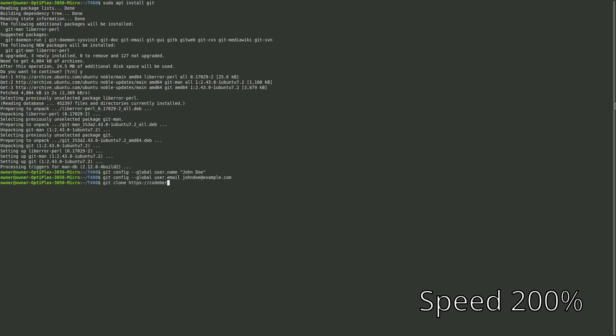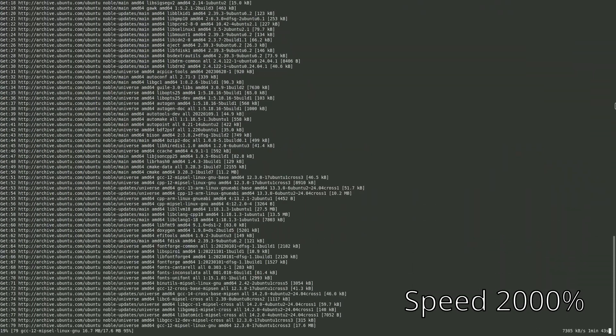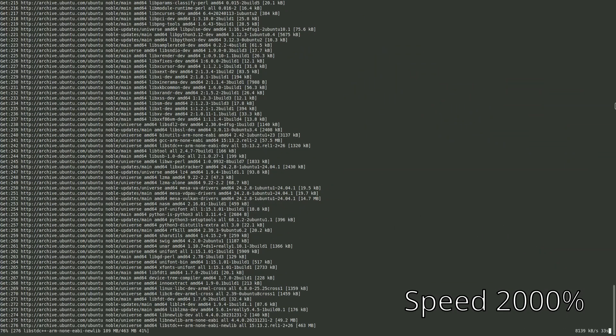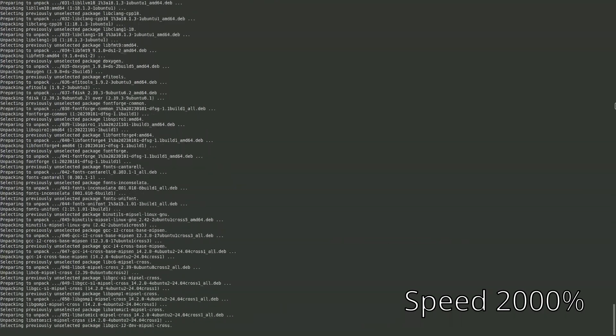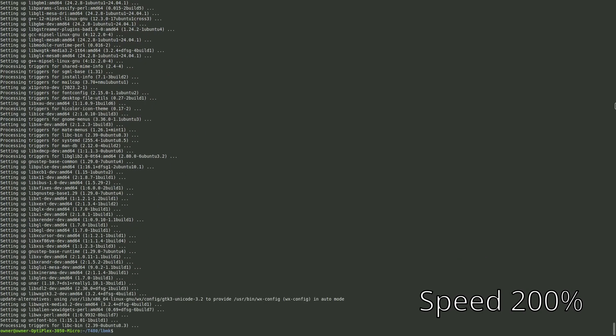From here we're going to git clone the Libreboot repository: https://codeberg.org/libreboot/lbmk. This will clone the repository into an LBMK folder. Then CD into it by typing cd lbmk. I'll also type export XBMK_THREADS=4 to tell it we have four threads and speed up the build. Then run ./mk dependencies mint to install all dependencies — if you're on Ubuntu, Fedora, or Arch, check the dependencies file and run the appropriate command for your distribution.